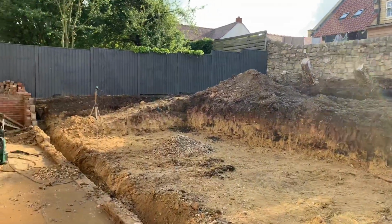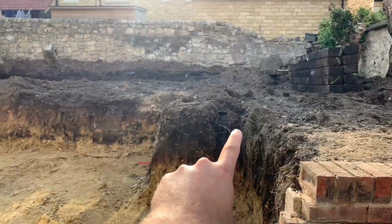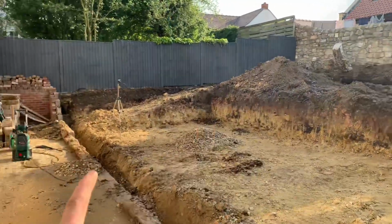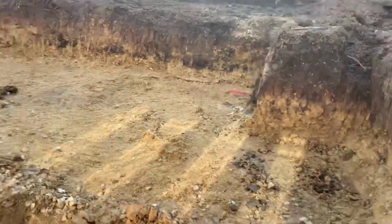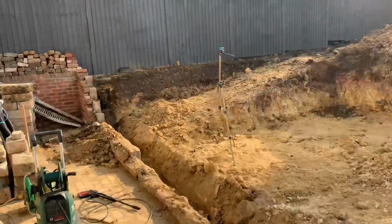All dug out. So what we've done, we've dug in 2 metres there, 7.5 metres across, 4 metres deep. Patio's going to be 4 metres deep and 7.5 metres long. We've got this little barbecue area there, and then that's the ramp up onto the grassed area eventually.